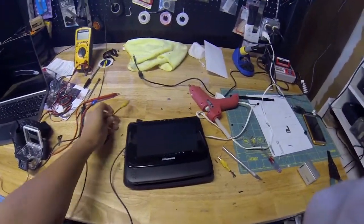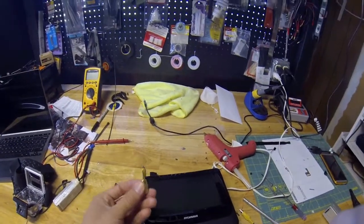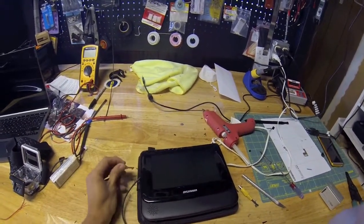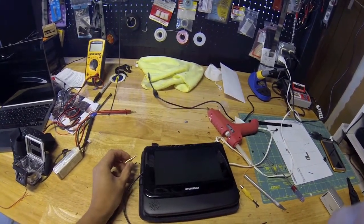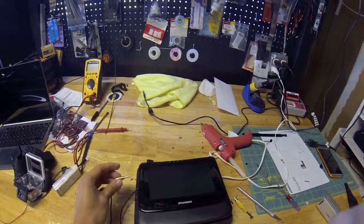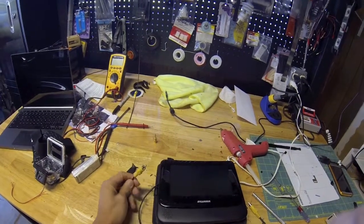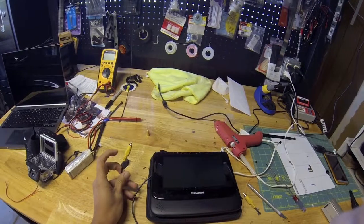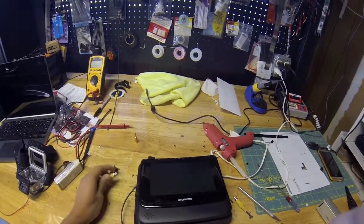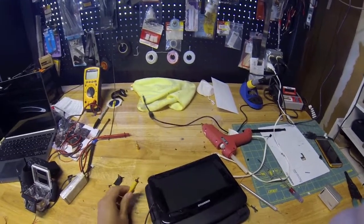So to recap: the audio jack connector on this display requires some sort of custom length plug. Your standard audio jack will not get far enough into the receptacle to send the video signal to the board. I tried opening it up and modifying the pins — that didn't work because the video signal comes out of the tip and there's really no plug I could find that was long enough. You could go on eBay and buy the custom plug set up for this monitor, or you can do what I did: take a standard RCA plug, cut off one end, and solder the signal to the very back pin and the ground to the pin closest to the outside of the monitor. When you do that, you end up with this cable running out and you can plug it into any video source, and it should work. Thanks for watching.